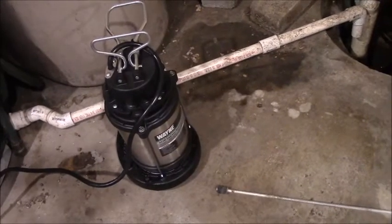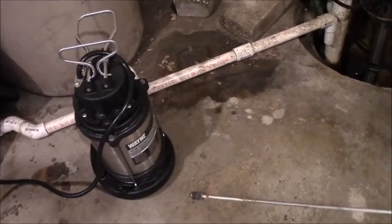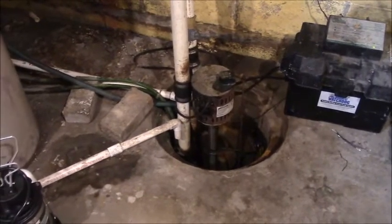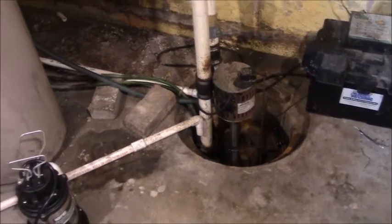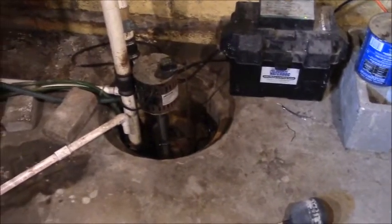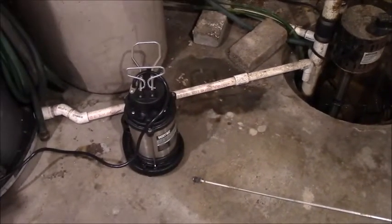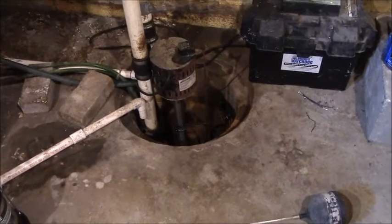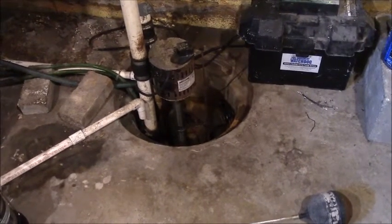So what I'm going to do is pull this whole unit out. I got a brand new submersible Wayne pump — a good pump, they'll probably be quieter. We used to have one with the motor above the waterline because we used to have a wood furnace and it heated the water very hot. When they overflowed, it blew the pop-off valve into there — 180-degree water — and that's not rated for that, these submersibles aren't. But now it's just cold seepage water.